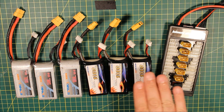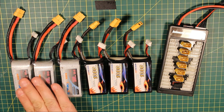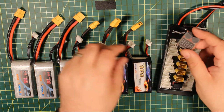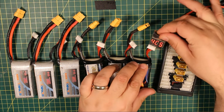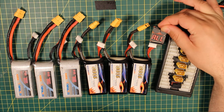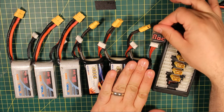The other rule is that the battery cells all need to be approximately the same voltage when you start. So for that I have a battery tester. This battery here is 4 cells and it reads 3.79, 3.78, 3.78, 3.79 — all of those cells are about 3.79.